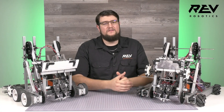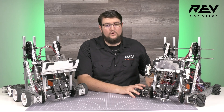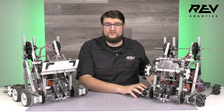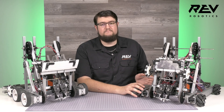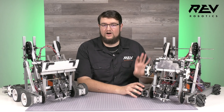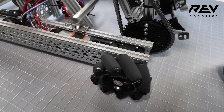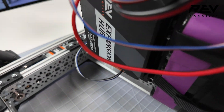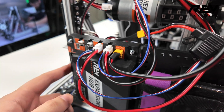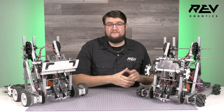The obvious upgrade implemented for the Starterbot this year was changing over to the Mecanum Drive system. We used the Rev Mecanum Drive Train Kit V2, and after following the build guide, we just had to slide the middle rail back to accommodate our arm assembly. You can buy all the individual pieces, including the wheel set, to accomplish the same thing in your robot. Note that we needed to add additional ultraplanetary and HD hex motor kits to the build, as well as an expansion hub to control the additional motors — but the improvement in drive control really allows you to do some fantastic things.